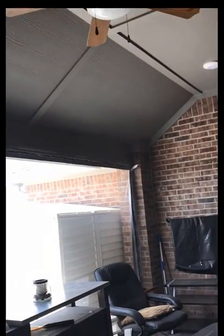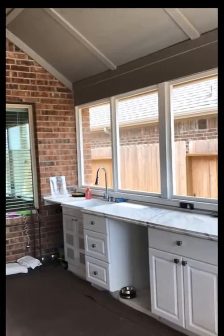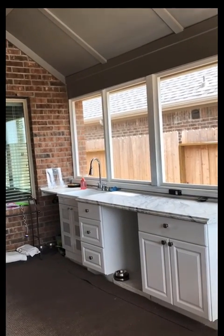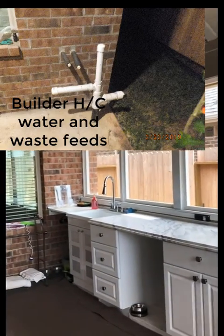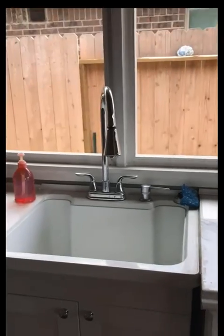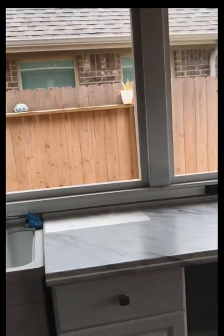All I did was put in the enclosures. I'm going to show you what we did. We needed a kitchen area down here. If you're going to do a kitchen with a sink, before construction starts you have to say: can you put in the waste and water supplies for me? You can't do that afterwards — they've got to lay that before they pour the foundation concrete. So we have official hot and cold water coming through, and a waste pipe connected to the main waste.